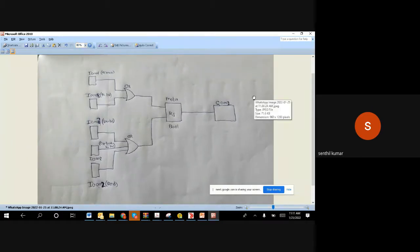Right. The one you see on the screen is the only one I got from you guys. Let us review how exactly the logic is implemented. When the green color is pushed, you wanted to start. That is correct. So maybe here you need to make a motor. You need to make an RS flip flop. The top one is S and the bottom one is R.